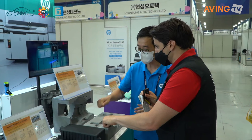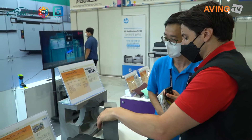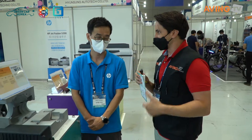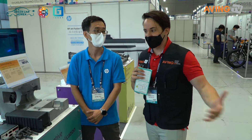This particular automotive part is made much lighter because of one material — polyamide, or nylon. Also because of the honeycomb structure shown here, we're able to make parts of the cars a lot lighter, which of course is very important in the green car industry when you're trying to extend the number of miles you can drive on one battery charge.